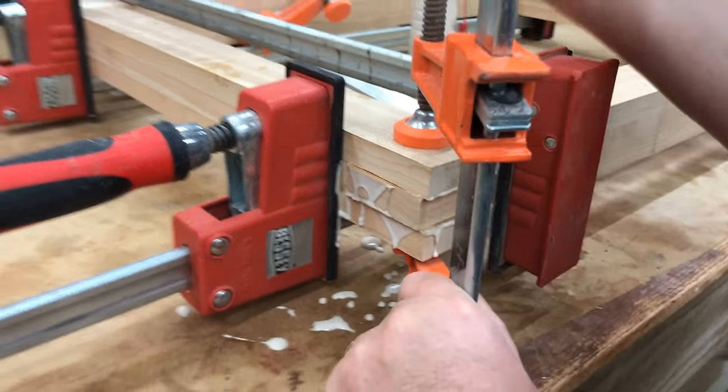And this is probably a good point to pause for just a minute and talk about the project if you are going to build something like this in stages. From this point, you would proceed and build the torsion box top. You could attach the torsion box top to this, like so, and then you really have a fully functional torsion box top assembly table. You would never need to do anything beyond this point if you didn't want to. Even the electrical at this point is an option. But this at least is a stage for you to get started.